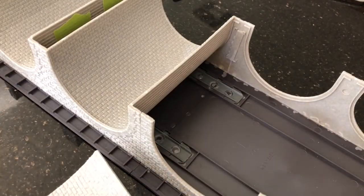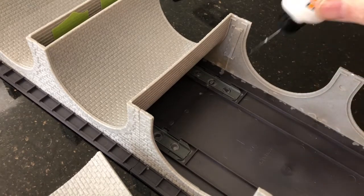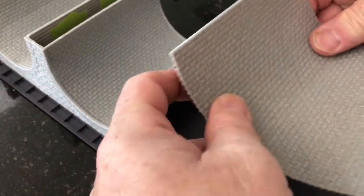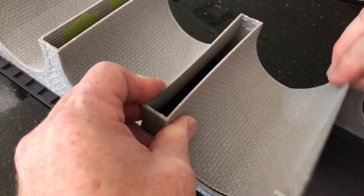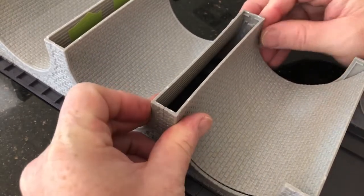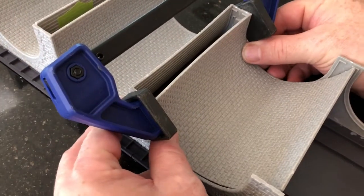So this is going to be the third arch. I'm going to use my second one that didn't break. We're going to put glue beyond the halfway point in the groove because we don't have access to it like we do on the end piece when we start out. We're going to work this in, avoiding bending the center because we already know that's the weakest link. Let's walk it in, make sure it's level, and then apply a clamp here to start, and then push the rest of it into the groove.